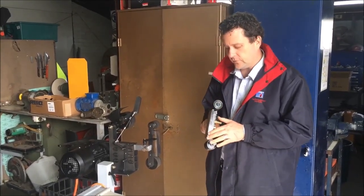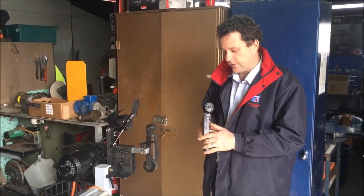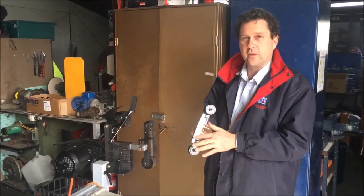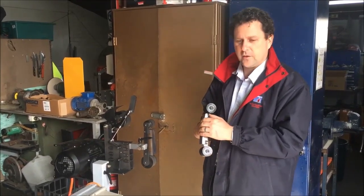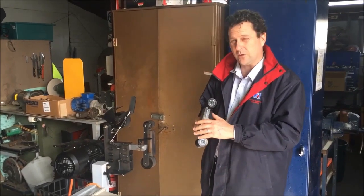The radius platen means that you can basically grind as if you had a very large wheel on this grinder. Even though it's only a 2x48 inch belt, this radius is off a 72 inch wheel — so that's a six foot diameter wheel — very nice for the backs of Japanese kitchen knives and big hollow grinds.